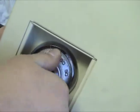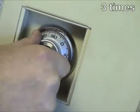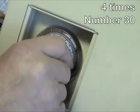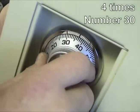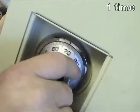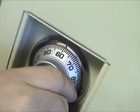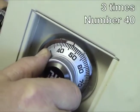With the change key in this position, turn the dial to the left, stopping when the first number of the new combination aligns with the changing index the fourth time. Turn the dial to the right, stopping when the second number of the new combination is aligned with the changing index the third time.